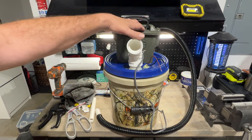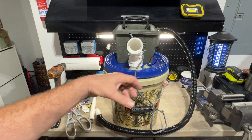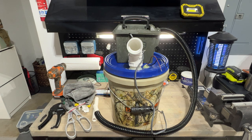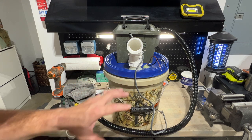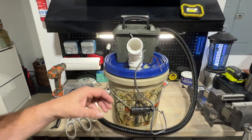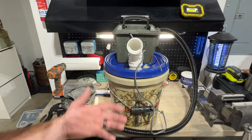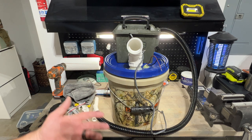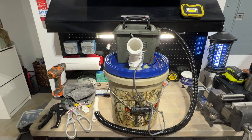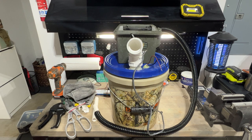My next goal after this is I want to build what's called a power log and utilize a 12-volt pump. I'm going to build a power log the same size as this, but I'm going to run it straight into the high banker and make a mini dredge. I have a short one about having the pontoons that I have. So this is all phase one of that, playing around with a 12 volt pump system. The next phase is building that power log and seeing if I can shoot the material straight into the high banker with it floating on some small pontoons and still be light enough to carry around, without all kinds of bulky equipment. Make a micro dredge that way. But bucket dredge, anybody can make something like this. And it's better than pumping with the hand dredge for sure. Like I have the Gold Fox, so I already have the system. A few parts and pieces and a little ingenuity and away you go, people.